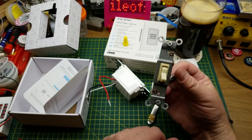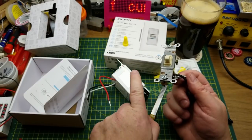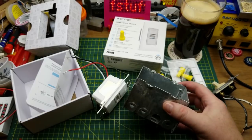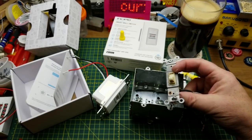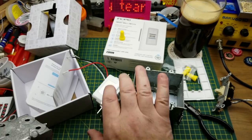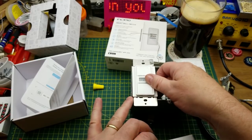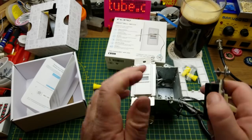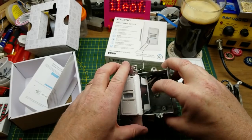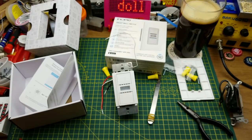Here would be the standard type of switch you'd normally find in the box on the wall — that would get removed to put this in, and this will just barely fit into the box. This is a double gang box that would take two switches or two plugs. That single gang just happens to have a plug in it right now. This guy would just screw in right there and there's just barely enough room, with a more standard switch sitting beside it.